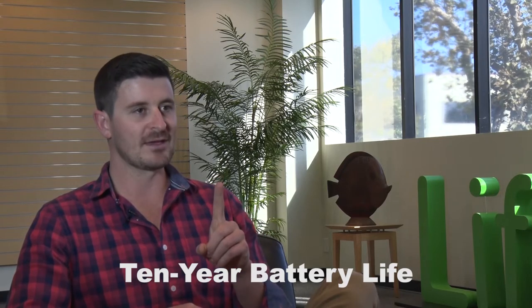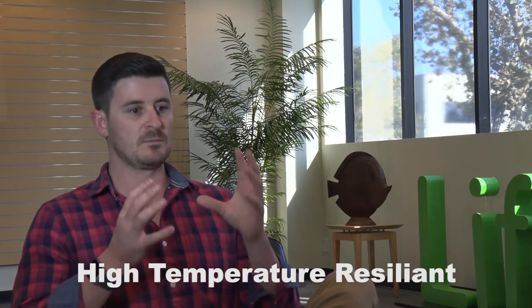But there is one more thing, and this is kind of a big one. Provided my territory is in Southern California, temperature resiliency is huge. A lot of these environments that these units are placed into aren't climate controlled, and that would affect the longevity of a lead-acid battery. But it's not really going to affect the longevity of a lithium-ion battery, because they actually operate pretty well under higher temperatures.